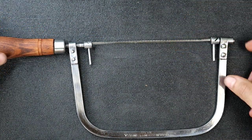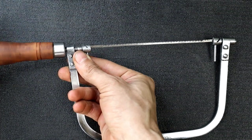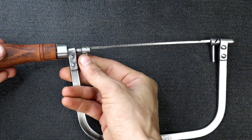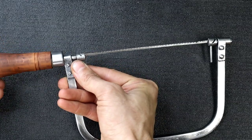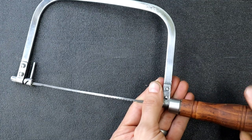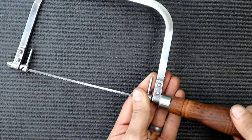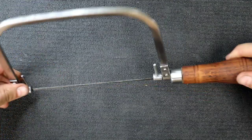I typically use their medium blade, but they have blades from extra fine to coarse depending on the job. You'll be able to cut wood, plastic, or metal with their blade selection. Remember, hold the arm while you tighten the handle — the extreme tension along the blade makes them vulnerable to breaking if you let the blade twist under tension. I often get asked about how much to tighten a coping saw blade. These blades are tempered or made of carbon steel, so they should not break due to tightening.